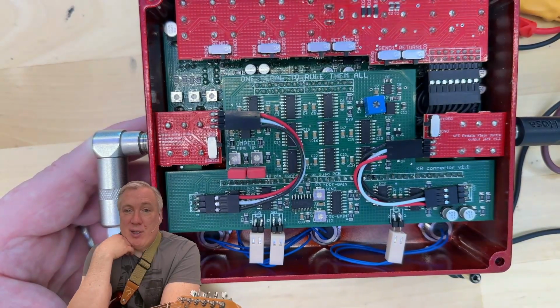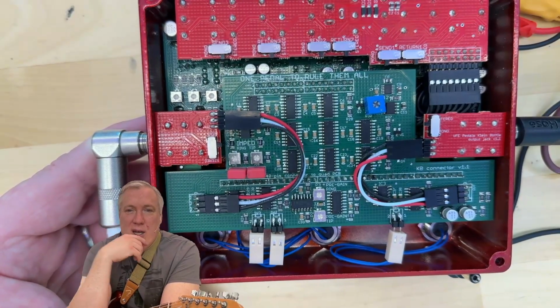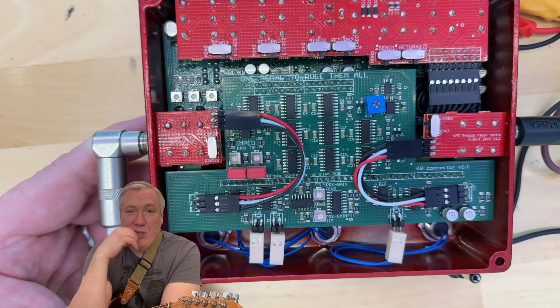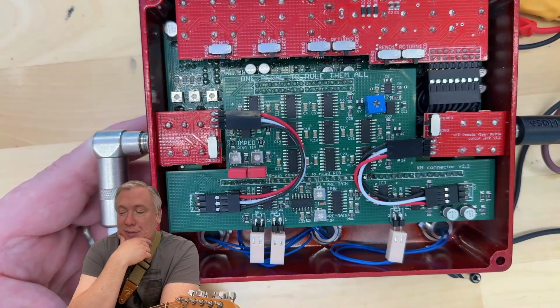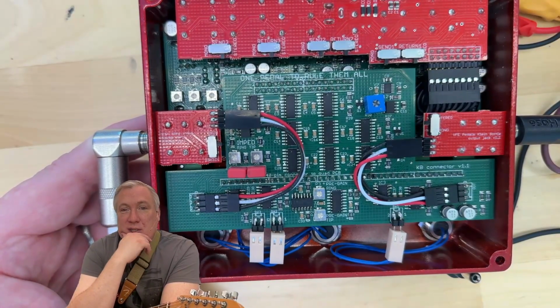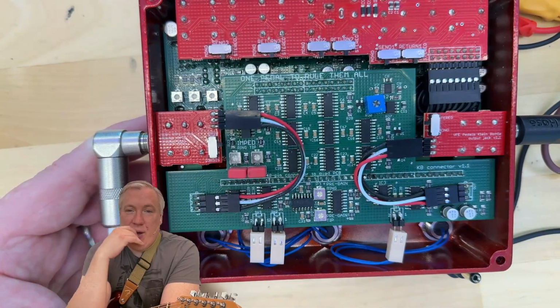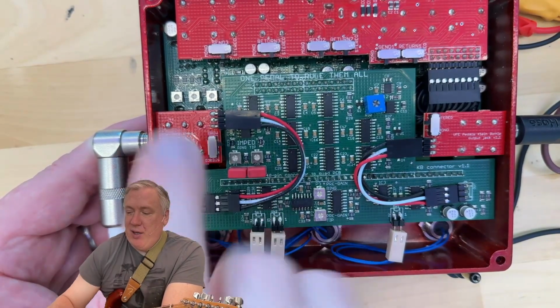In my experience, if you're getting close to or potentially exceeding a current draw spec, even if you stayed slightly under it, it does mean that it may eventually fry just from overheating. I don't want to take that risk. So that's why there are two. But because there are two, there's a theoretical possibility, unlikely but theoretical, where they can interact in a way that creates a whine.